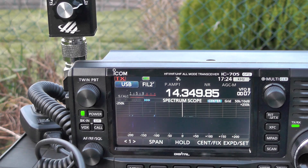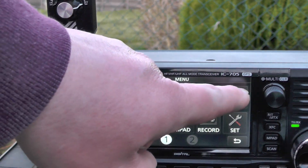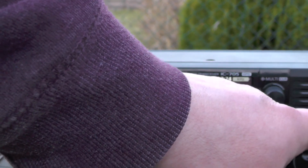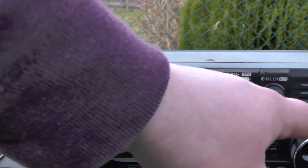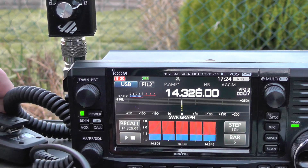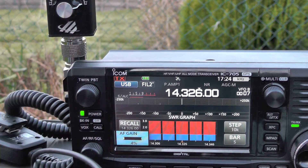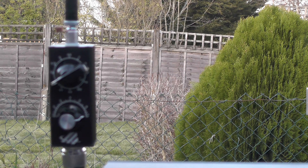We can check the SWR in this radio. I'll press the menu button and go to SWR, scroll down, just check there's no one else on the frequency, and we'll check the SWR. Way too high. The instructions on the back of the antenna say SWR should be 1.5 or below. So I will add the counterpoise wire — which will go on the antenna — as and when the wire comes, and I'll do that in a future video so we can get the SWR to come down.